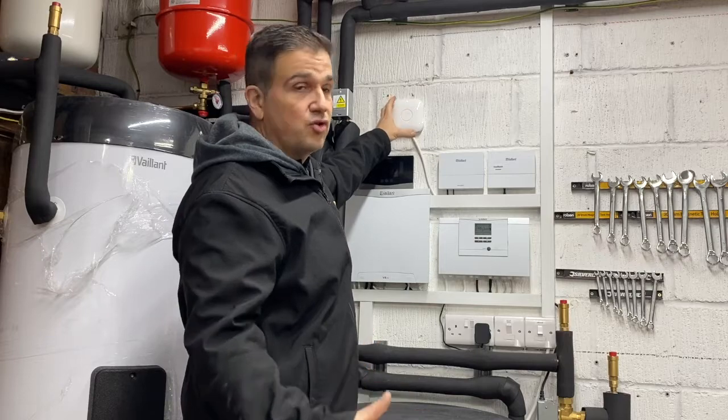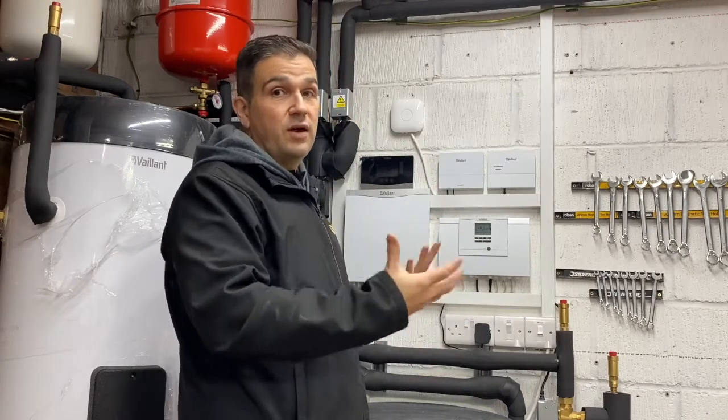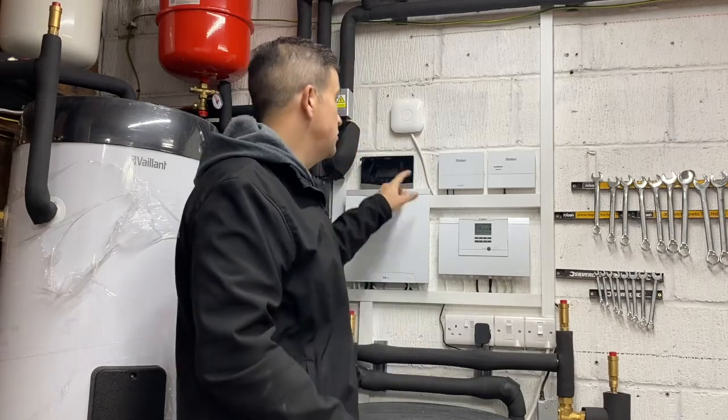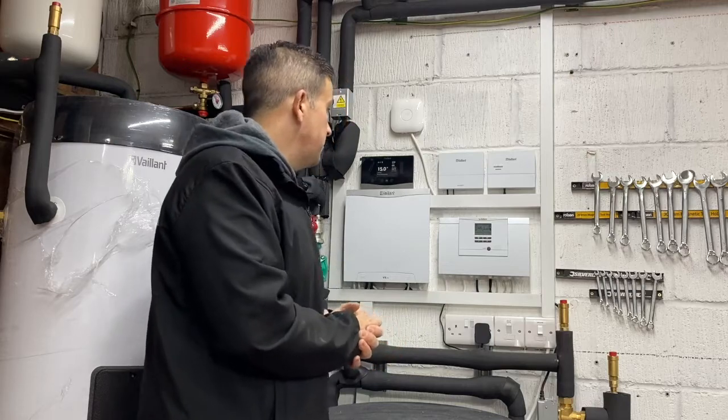The Nest is set up as a third-party heating control — it talks to the heat pump and tells it when heating is required. We've also got the Senso Net, which is your internet connectivity. This means you've got the Senso app, which enables us to link online — so from the office 20 miles away I can check what could be causing a problem. It also provides energy consumption rates: how much electricity is being used, how much heat is being generated, and the COP — if I'm putting in one kilowatt hour of electricity, how many kilowatt hours am I getting out.